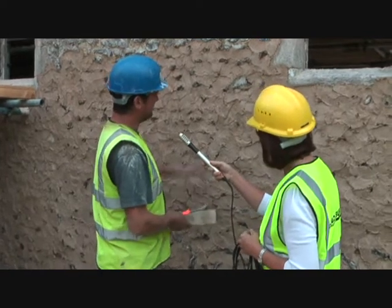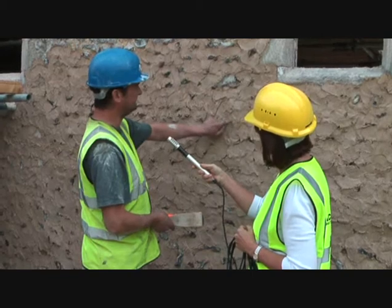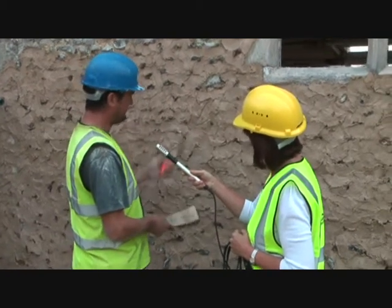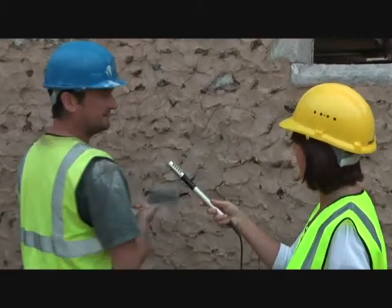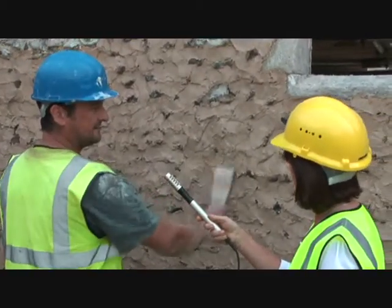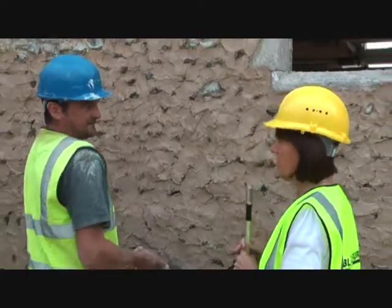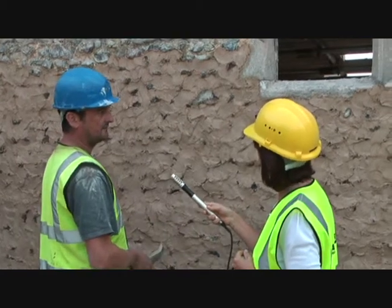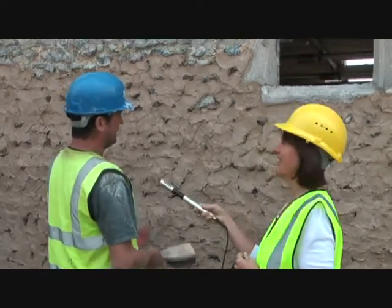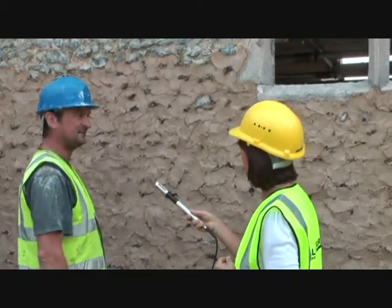You brush it back to a nice flat-ish surface, so it shows the aggregate in the sand. But with that, you end up with lines. So then use this brush, and you go over it. The bristle brush just gives a softer finish, just smooths it off. It takes away the lines from the wire brush, basically. Excellent. Yeah, and that's it. That is basically the pointing up with flint work.